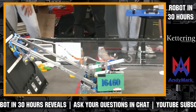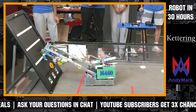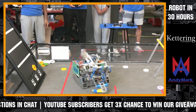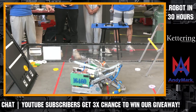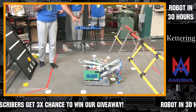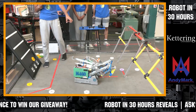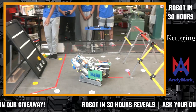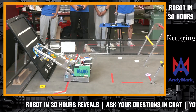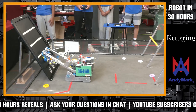After we drop the robot, we can run through each of the states. The robot can easily transition between four states. The first one is this resting state on the ground, and then after Matthew finds the correct pixel that he's going to pick up, he can hover over it and go into the pickup state, which then the claw goes onto the ground. Then Matthew will back up, pick up the pixel, and drive over to the backdrop. After the backdrop, Matthew can press another button which will raise up the elevator very easily, and then he'll be able to drop it onto the backdrop.